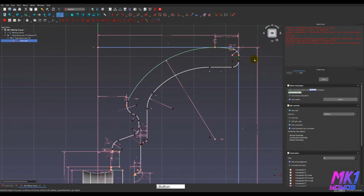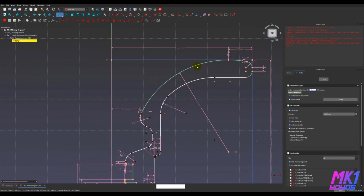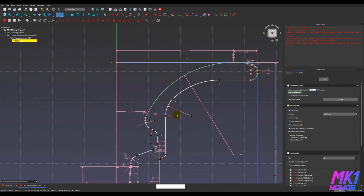I'm going to go ahead and constrain this line here. I hit the wrong key. Shift D. Let's do 0.6. Make it a short, flat little section. That may need to get adjusted later. And then I'm going to move this line over until this starts to get thin. So the steel ring is going to be up here, so I'm free to remove stuff from over here until it starts looking good in terms of being efficient.